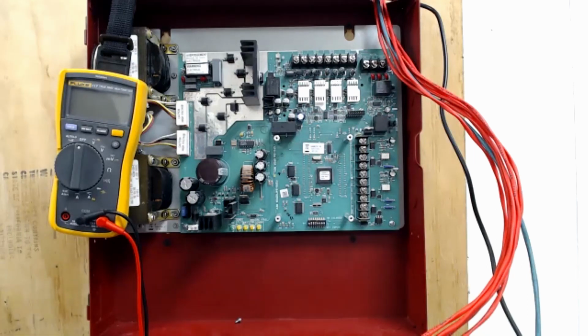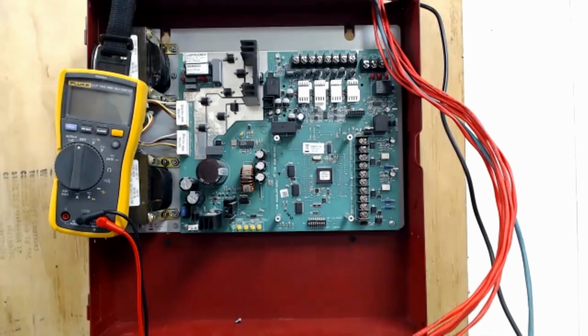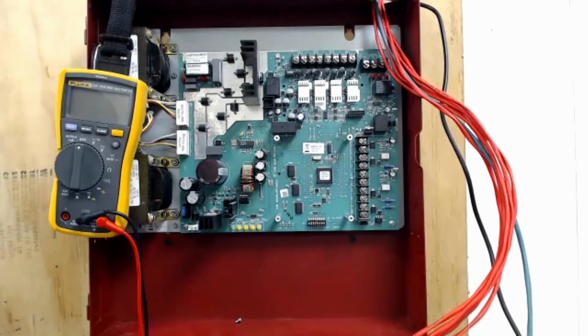And the way I'm going to wire this up is assuming that there's a service loop up in the ceiling above this. Also, coming in right here where the wire's coming in, there should be conduit in a connector. I didn't run conduit in a connector to mount this on the wall for me to pull it down 30 minutes later. It didn't make sense to take all the time to deal with conduit. But just know there should be conduit here, and pretend that there is. I'm going to ask you to use some imagination. So we have a service loop above the ceiling and we have conduit.